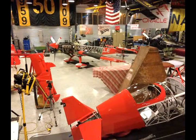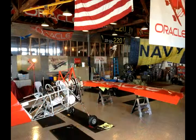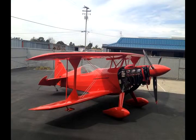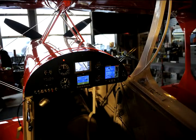The aircraft, in all of its many pieces, will then return to Salinas where it begins getting reassembled. We'll rehang the engine, reattach the wings, all the flight controls, and all the side panels. We'll finish assembling the airplane, test run it, and make sure all the rigging is good. Our goal this year was to test fly the aircraft on March 4th, which we did about an hour ago.